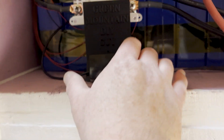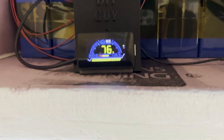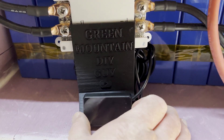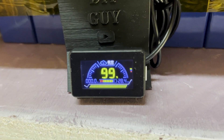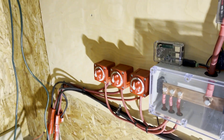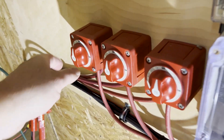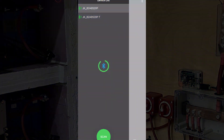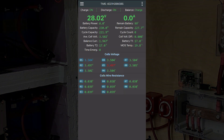Moving forward, I needed to make sure the voltage between the two battery packs was the same. The top one was at 26.9 volts and my new batteries were at 28.4 volts. By connecting both batteries into the same bus bars, this allows the batteries to equalize to the same voltage — I believe this took a couple days, if not a week. Lastly, I made sure each JK BMS was working properly, set up, and ready to go.